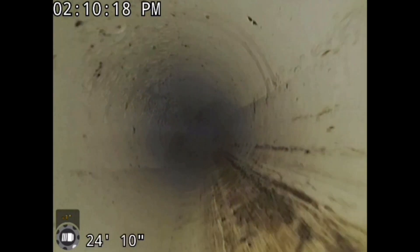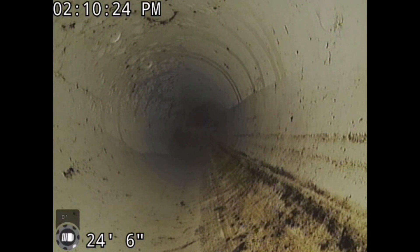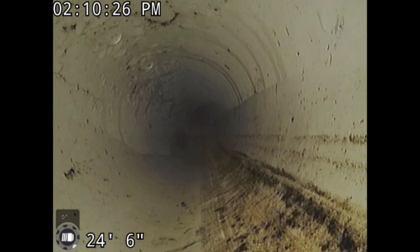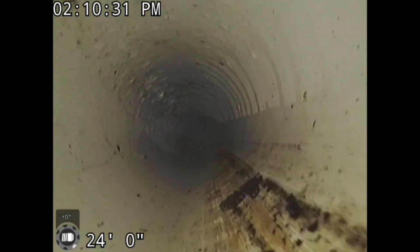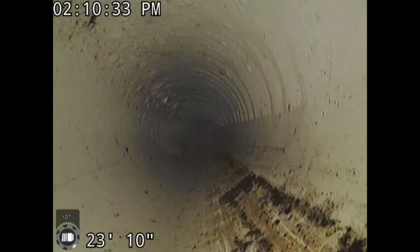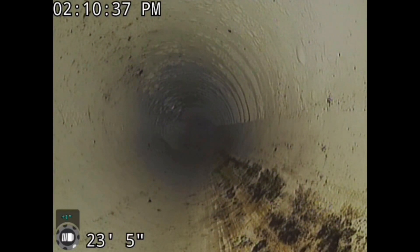So that's why the home inspector, the building inspector, makes sure all indoor plumbing is run on 1% slope. When you have a smooth bottom pipe like PVC, it has to be at 1% slope. A lot of condensation right here — you can see it up top, just building up. This is a discharge line for a downspout. But if it was a French drain, they look the same.